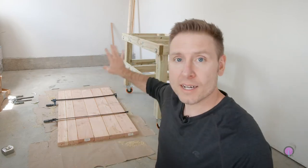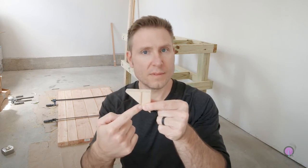Now that I finally built the right sized bench top, I'm going to stick that on top of the frame and screw it down. I'm going to use these little L-brackets that you can pick up anywhere — these are actually made for putting together outdoor decking. They make longer plates and shorter ones so you can buy what's appropriate for you. You can also just use little 45-degree triangle wedges of wood and nail or use wood screws to secure the top to the frame — that's a much cheaper option and probably just as good for the type of thing I'm going to use this for. Honestly, I probably could have put this entire thing together with nothing but nails and wood screws and it would have been fine. But it's called Overkill Projects for a reason.